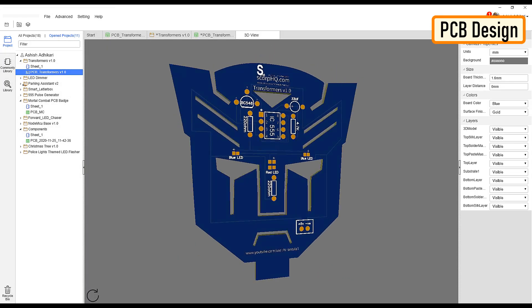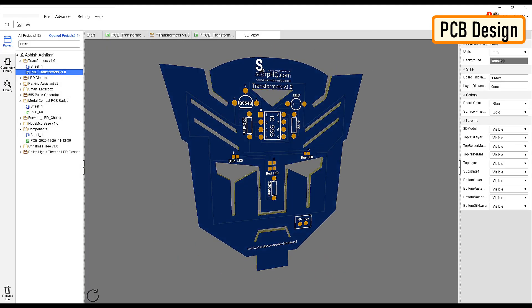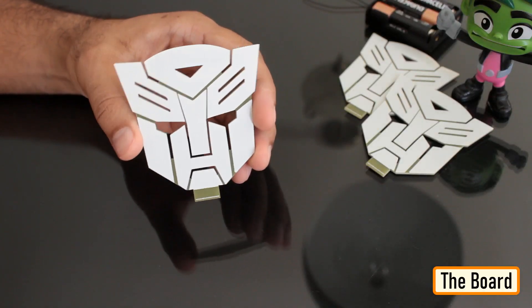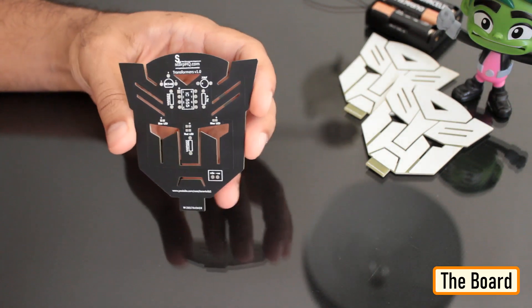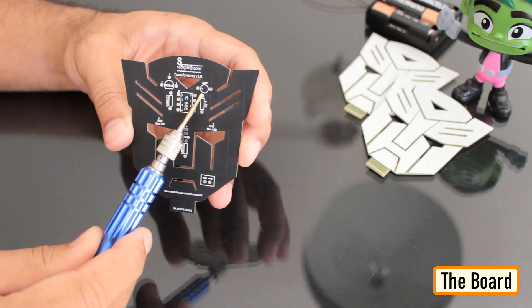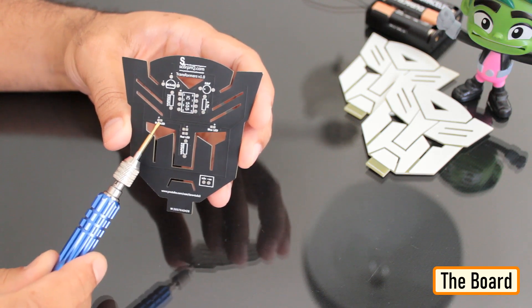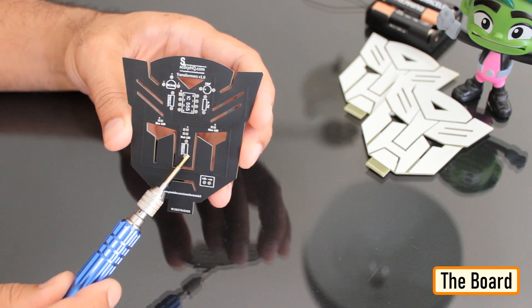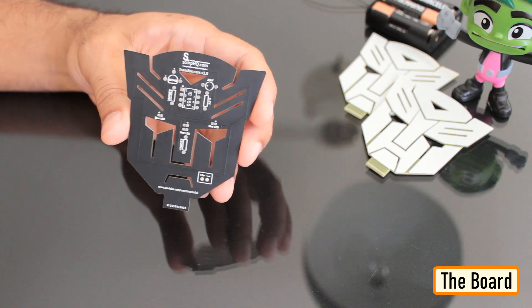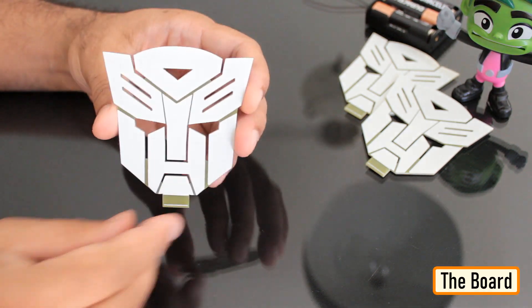All done — this is how the final design looks like. This is what came in the mailbag. Have a look at the quality — it is absolutely mind-blowing. At the back of the board are all the exposed copper parts for soldering the electronic components. I could have designed the board with SMD components; however, I wanted to design something that someone with zero SMD soldering knowledge can also do.